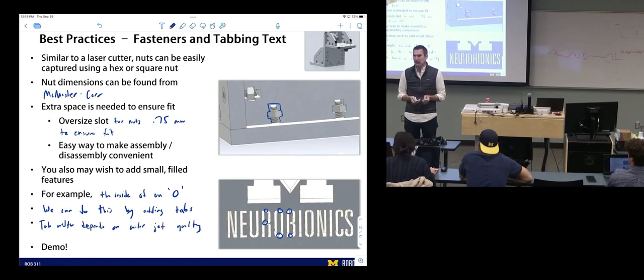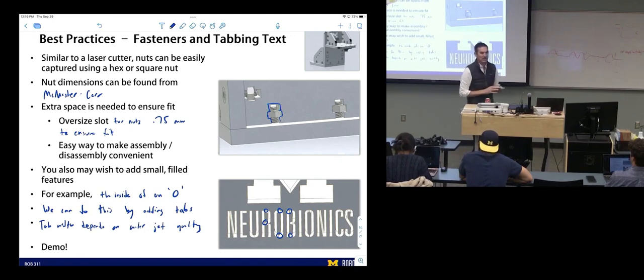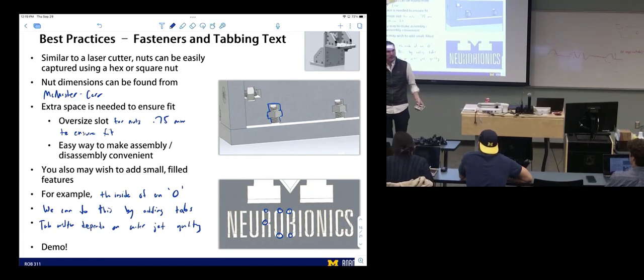How could you tell which side is facing up? The side that has the cut kind of going in would be the side that the water is hitting, and then the metal is escaping out the back unless it's been deburred. The burrs would be going out the back end. I don't know that you can really see that. If we think about what our taper looked like, it's a V, yeah? And it's gonna be open at the bottom. So if you look, the back is more blown out than the front. And you'll see it looks worse. It's not as high fidelity a cut.